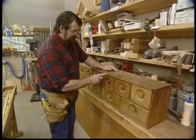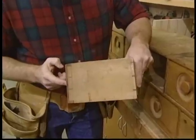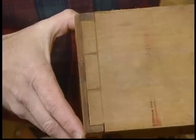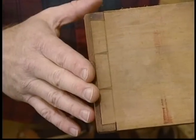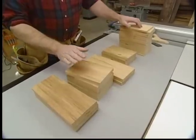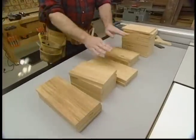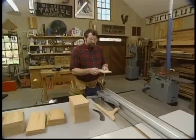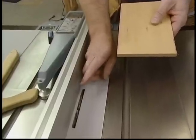One of the most appealing features of our nest of drawers are the drawers themselves — just look at the craftsmanship. The sides are joined to the front with half-blind dovetails; the sides are joined to the back with through dovetails. These were all hand cut — this line is just a score mark used for layout. We're not going to cut them by hand; we're going to use a router and a dovetailing jig. Here are all the pieces for the drawers, milled out of my remaining recycled pine: drawer fronts at eleven-sixteenths of an inch thick, back pieces at three-eighths of an inch, and sides at three-eighths of an inch. The first milling operation is to put a groove along an edge of each side piece. I've set up my stacked dado head cutter for a quarter of an inch width and an eighth of an inch depth. Without changing the setup, I need the same groove along the bottom edge of each front piece.